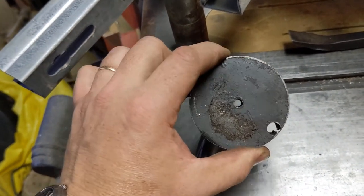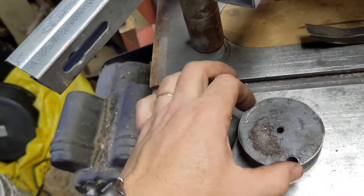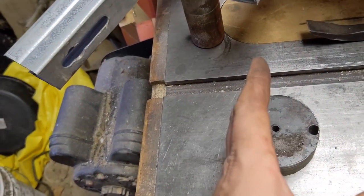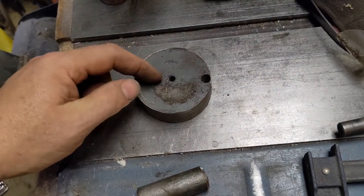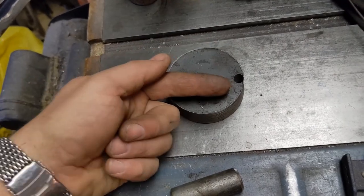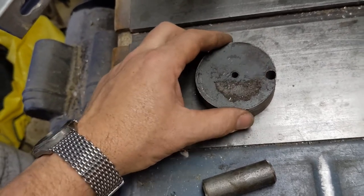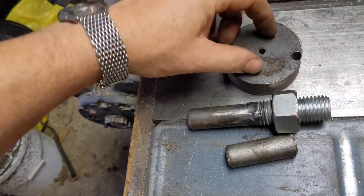For that I'm going to take this plug of one-inch plate from when I made the mill head alignment system. Because we are tight to the rest of the mechanism of the tractor, cutting this in half longitudinally and drilling it right there will work great. The pressure when the bucket is trying to detach will be trying to pull the pin this way, so we'll have a hole approximately here — all this meat to stop that pin from sliding that way. It won't have a lot of meat out here, but that meat doesn't matter because it actually can't go that way. We just need something to resist the pull in this direction. We want a large bearing surface to spread the force out over a lot of space — and that's where this one-inch plate comes in handy.